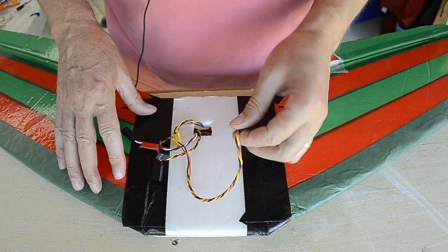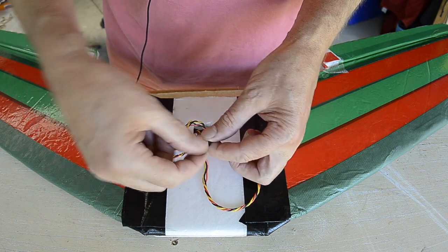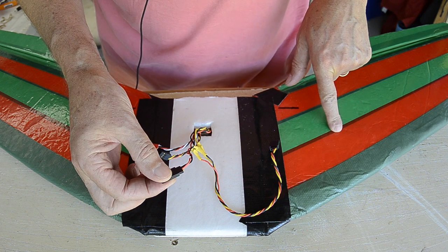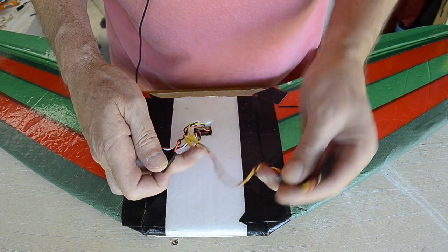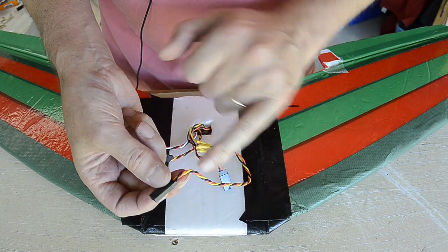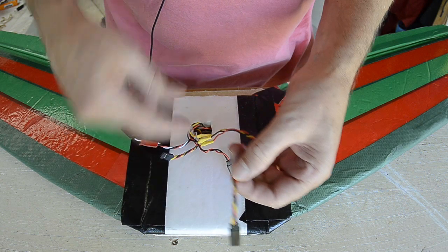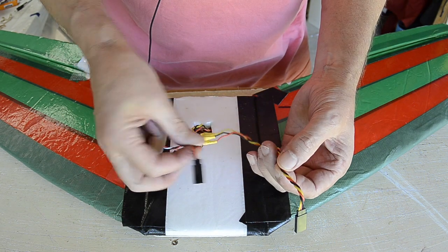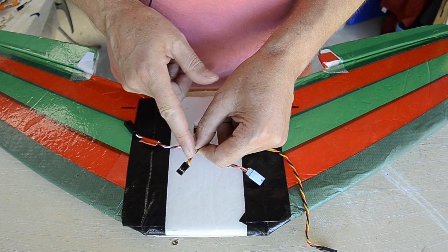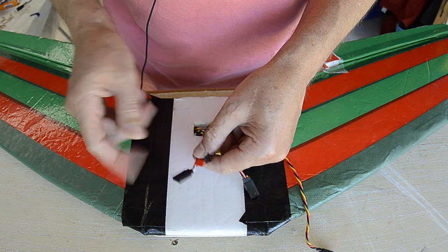On the bottom of the wing, power from the LC filter comes in and sends power out to the video transmitter and to the camera. The wire going to the camera sends the video signal out to the video transmitter as well as receiving power via the LC filter. There's also the connection for the current sensor telemetry back to the receiver, and that's power to the receiver.